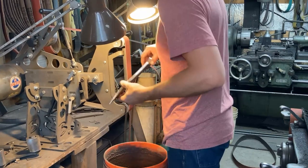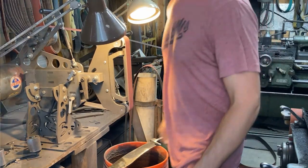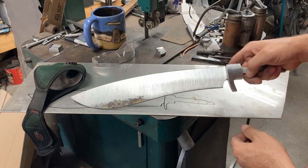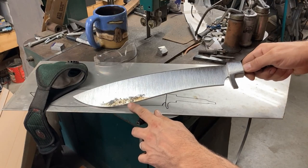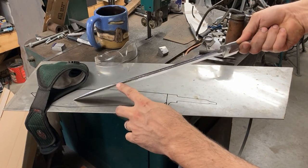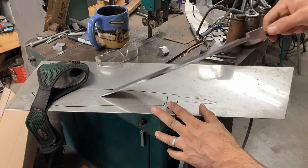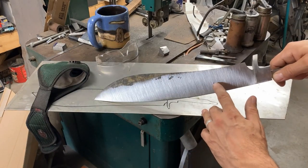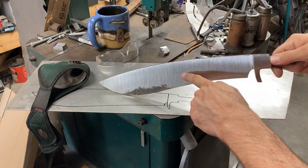That's starting to look pretty good. Let's have a look and see what the next step might be. All right, a little progress report — you can see we're getting this blade pretty clean. There's some scale here at the belly because of the drawing we did in this section just to pull that width out a little bit wider, so this is expected. There's still plenty of edge thickness and it is centered to work with here in terms of grinding our edge into it. Same thing on the other side — everything else is cleaning up, we have isolated small scale patches barely left and those will grind out pretty soon.